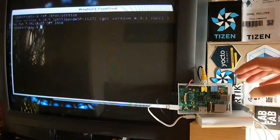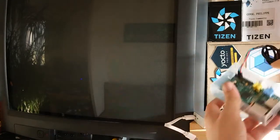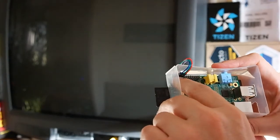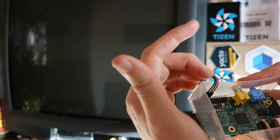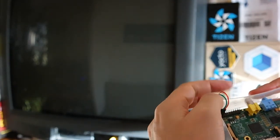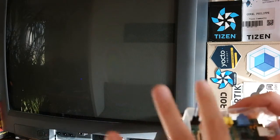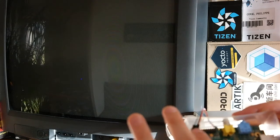And before I leave, I wanted to tell you about this. If you have a serial adapter, which is quite easy to get but very helpful for development, what you should know is that if you want to wire it, just don't plug into the first and second pins, because this is a power supply, but start on the third one, on the edge of the board. The ground is over there, so ground is blue on the Olimex cable and also others. And then you have transmission and reception. The next one is transmission, which is green, and reception is red, if I don't mix it up. If it doesn't work, try the opposite way. It could work if you have a different cable, but don't put one of those on the VCC.